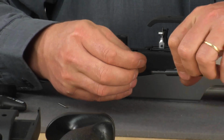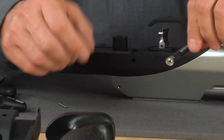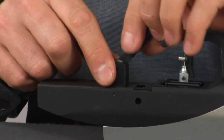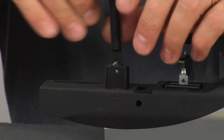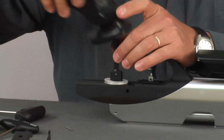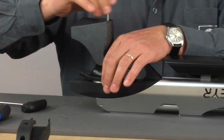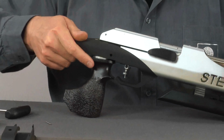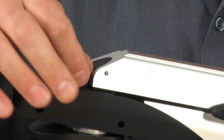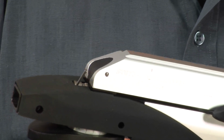There is a small amount of grease on the grip rod so that the STEYR lock washer is held in place. The pin is pushed in. The grip angle adjusting disc is put back in place and the grip remounted. It is now possible to adjust the velocity externally, turning in a clockwise direction increases the velocity, whereas turning in an anti-clockwise direction reduces the velocity.